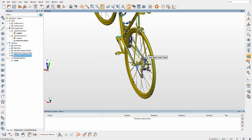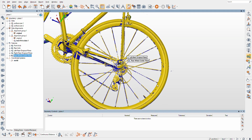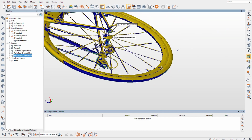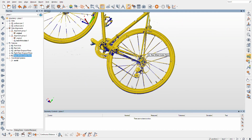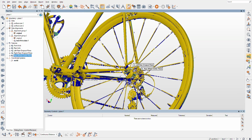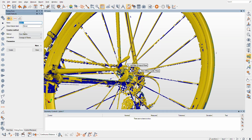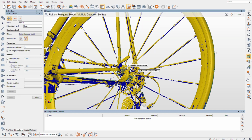And now what I'm curious about is, is it in the center? So if I use the braking surface of the rim, is the rear center plane the same as if this braking surface was a plane on this side and on the other side, and then we made a center plane between those? Is that the same plane? Or what's the distance between that plane and the plane that I just created in between the dropouts? So I'm definitely going to do that. I was kind of curious about that. So